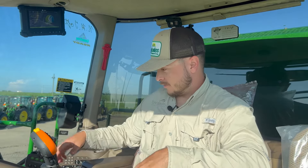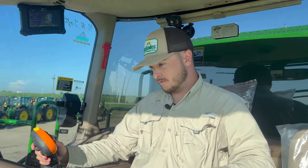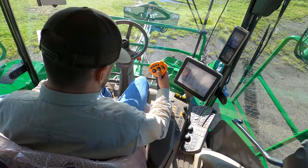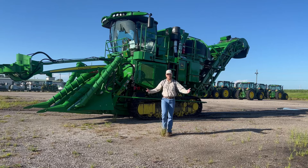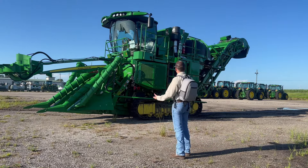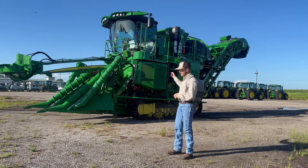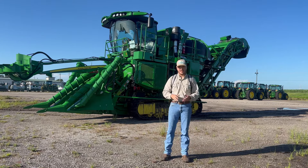Back at home base. I'm going to set the frame down here, right on the floor. There we go. And that is how to operate a cane harvester. That's it for cane harvester 101. You should also add: never leave your battery switches on — your main battery power switch — on over the weekend. It could be dead come Monday, and they're not a whole lot of fun to jump. You've got to get up on the side there and plug jumper cables in. Not doing that again.